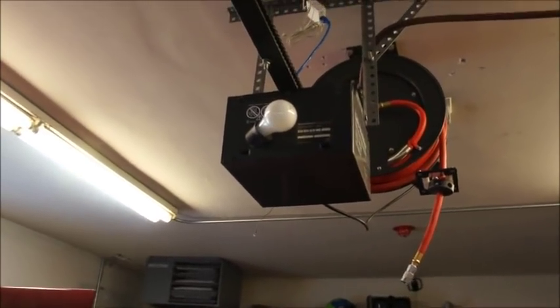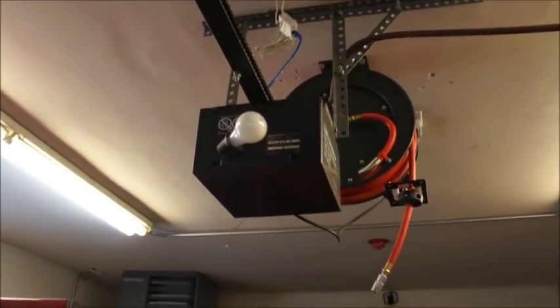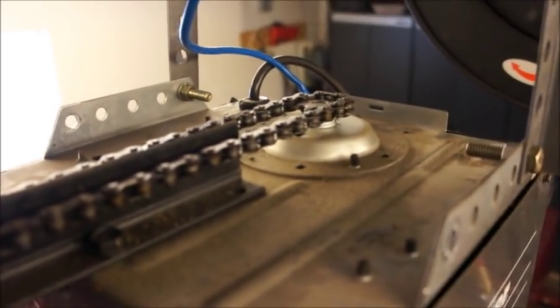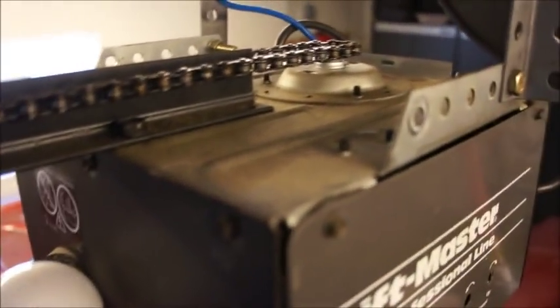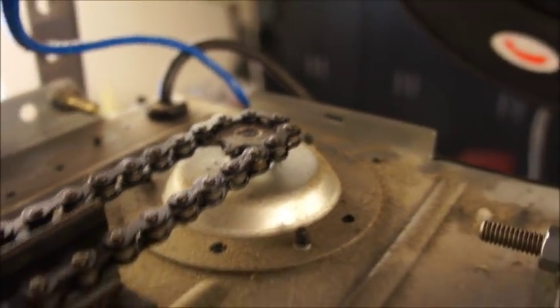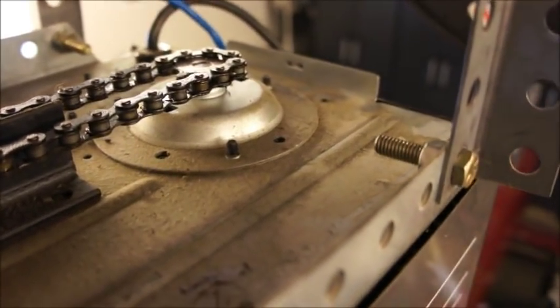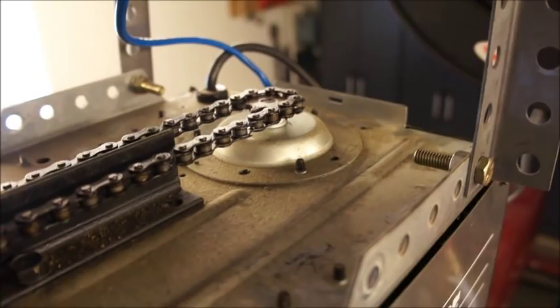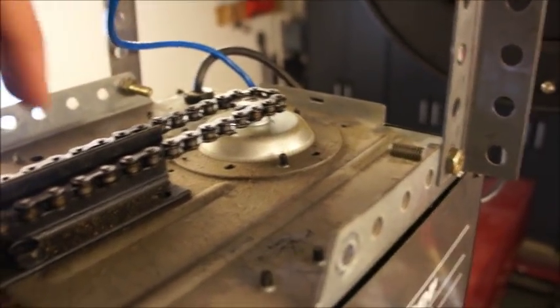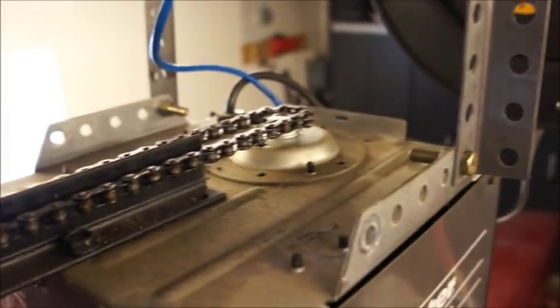I'm just going to give you a basic overview of the procedure to replace this, and you may need to use your best judgment at times. Let's start with the most difficult case to repair: the case of the broken sprocket. In this case, your chain will be dangling free and your sprocket will probably be broken off somewhere on top of the machine. Use your remote control or wall button and watch the sprocket or shaft inside. When it spins clockwise, it's closed all the way. Spin it counterclockwise until the machine shuts off, and that'll be open. I'll show you why that's important later. While the chain is still disconnected, pull the chain up so that the inner slide — that silver piece — is close to the top.